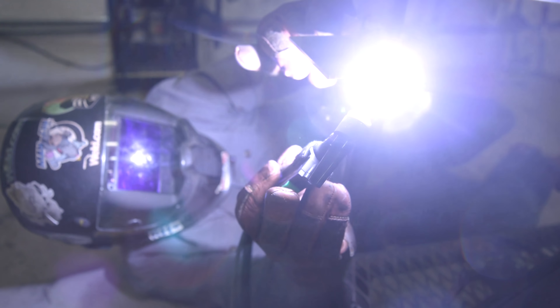Alright, so that was pretty good. I haven't done it for a while — it's a good refresher course. What we got on the weld: good tie-ins on the toes, nice and wet in, good start, built up good. Main thing is we kept consistent — everything was the same size carrying all the way down, that's what you want. If you want to check straightness, look down the weld like this and you can tell. It looks pretty good. I hope this episode has been very helpful. Learning is key. I'll see you guys next time. My name is Man Cub. Thank you.